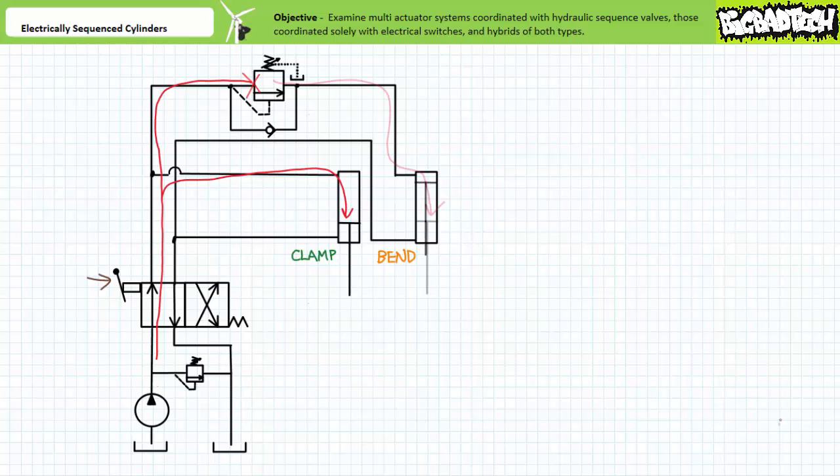In this upgraded circuit, when an operator actuates the directional control valve into the straight-through position, the normally closed sequence valve initially prevents the extension of the bend cylinder and only the clamp cylinder extends. When the clamp cylinder makes contact with the workpiece, pressure rises to the set value of the sequence valve. When pressure reaches 500 psi, the sequence valve maintains pressure in the primary circuit at 500 psi and opens, allowing the bend cylinder to extend. When the bend cylinder makes contact with a properly clamped workpiece, pressure on the outlet side of the sequence valve rises until the sequence valve is fully open. When the bend cylinder bottoms out or travel is otherwise restricted, pressure rises to that of the main pressure relief valve — say 1000 psi — and the bend cylinder bends the object. Note how the pressure decision made by the sequence valve coordinates the actuation sequence of this multi-actuator system using a single directional control valve.